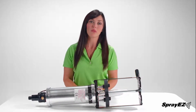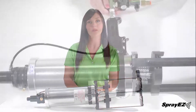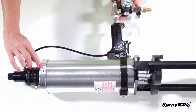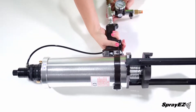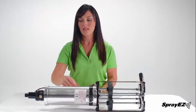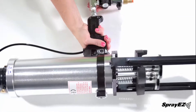When you pull the trigger, the air motor goes forward pushing both positive displacement rods at the same speed to assure you a two-to-one mix. You'll see your forward and reverse label. To test, push it to forward and pull the trigger. Then testing reverse, pull the trigger again.